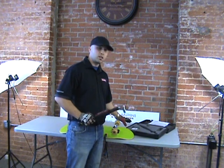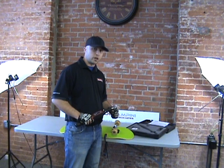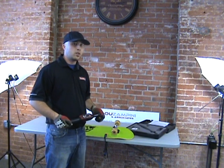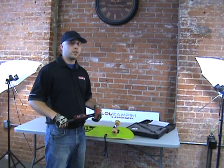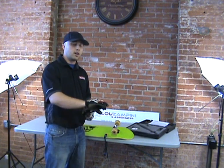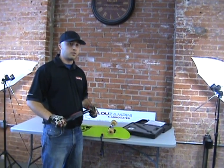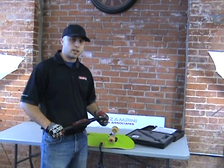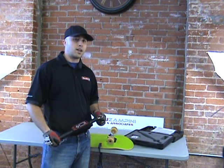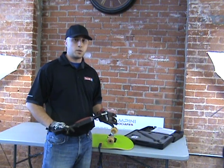We've already set this tool up for a couple of demos, and I'm going to show you two of the most common strategies used. The first is torque plus angle, which is common in the automotive industry — you get to a specific torque value and then add a number of degrees of angle on top of that to ensure the slack is taken out of your joint. The second strategy is residual torque check, which verifies the amount of torque already applied to the fastener after the fact as a quality control measure.